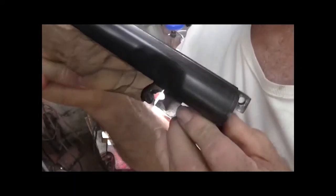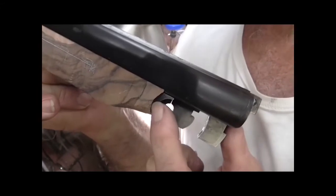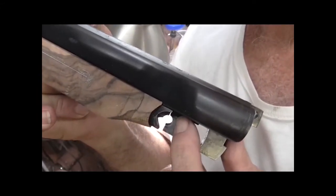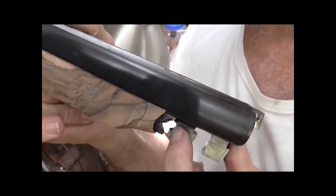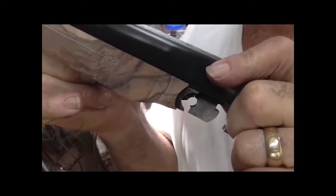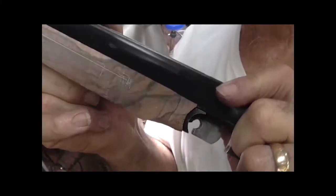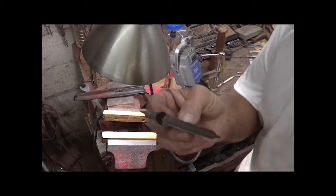The bottom metal contacts — it's kind of hard to see — but you see that little bit of gap right there? This metal contacts this metal and forms a hole where the barrel pivots. And that is really close contact. So I think I can go ahead and mill out for my release lever, which looks like that.